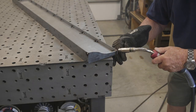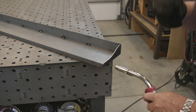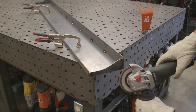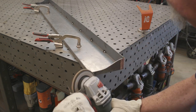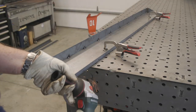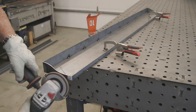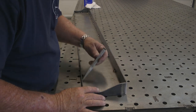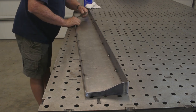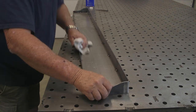I'm welding out the outside on both sides and then I'll get a grinder to smooth that off. With a 60 grit flap disc from Mercer, that's all I really need to smooth things off a little bit. I've been using 27 or 36 grit too — that's a little more aggressive. That's the beauty of having different grits in flap discs. The 60 grit gives a nice smooth finish. Then a little cold chisel to get all the BBs and spatter off the weld — just kind of clean things up a bit.